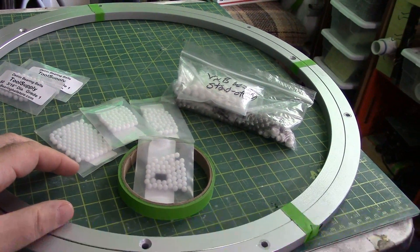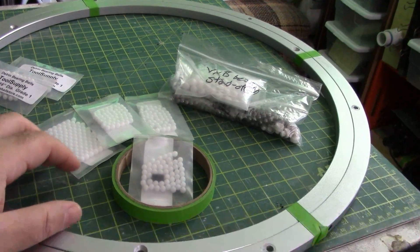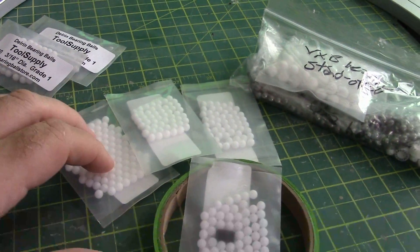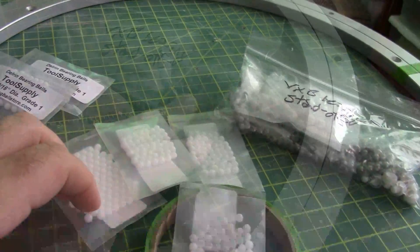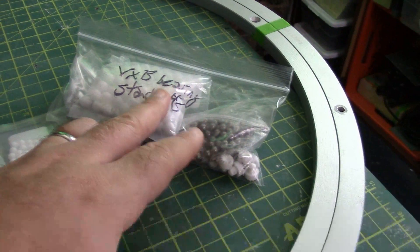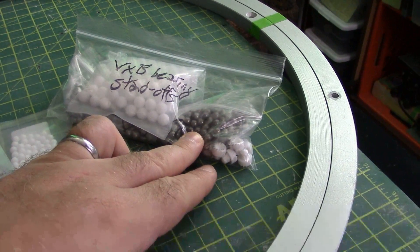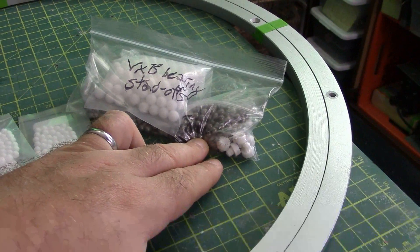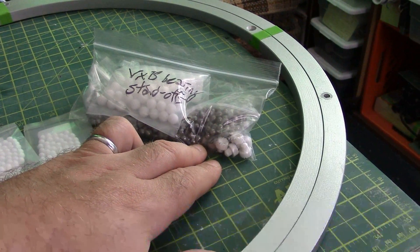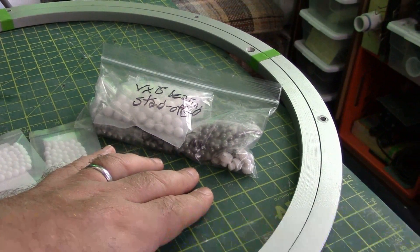The circle moved fair enough, but it really should be able to spin freely. One of the common tricks is to replace the standard steel ball bearings with what are called Delrin or Acetal bearings. It turns out there are 252 steel bearings in this VXB 18-inch bearing — really like 17-and-some-inches across — and it just barely snugs into the R2 frame.